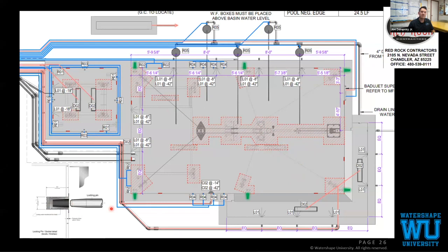As the floor rises, it puts tension on a chain that's connected to each one of these pins. As it gains tension, it basically inserts this pin into the wall. This makes it so even if you have a group of people walk onto the floor, you don't get that dock feeling where it's going to move up and down. It's just locked into place at the maximum height.